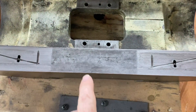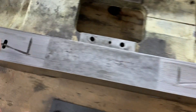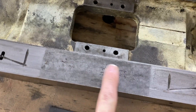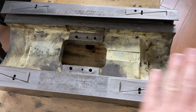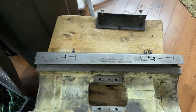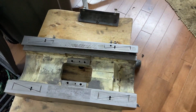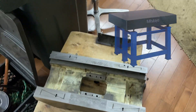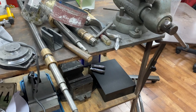If you look here, see how this has the original flaking pattern? And here it's all gone. So that means this is worn down below this level of surface. If I'm going to resurface that, I need to make that all flat and even on both sides. To judge whether it's flat, we'd usually use a surface plate, which is a very high precision surface. I have a little tiny one, but that's really not big enough for everything I need.